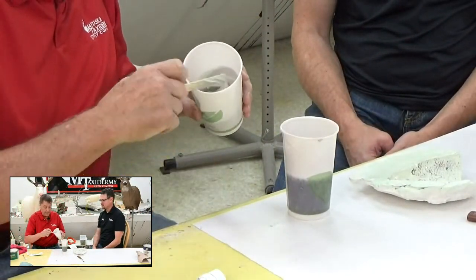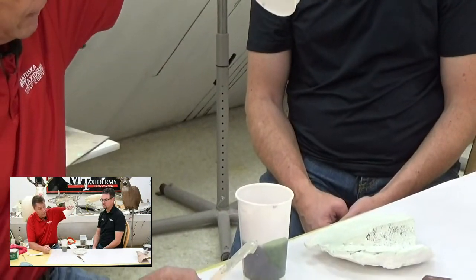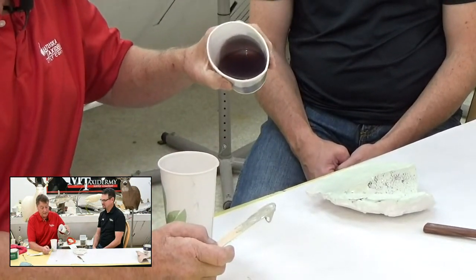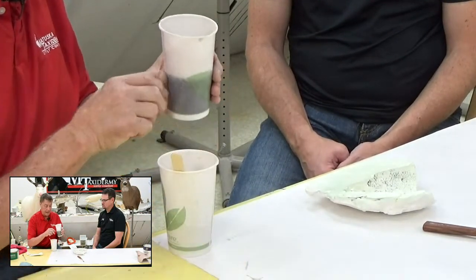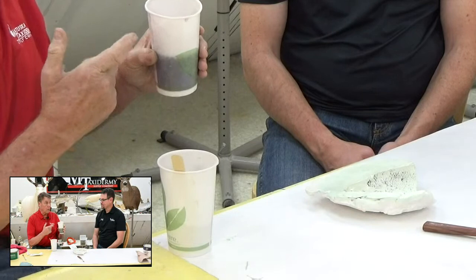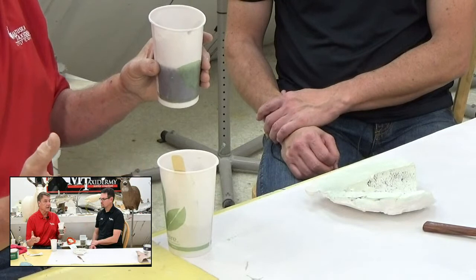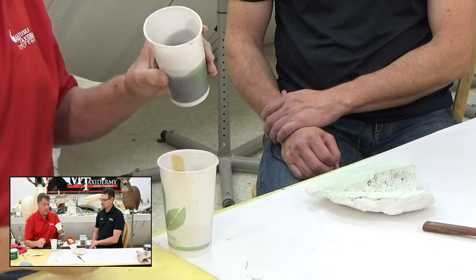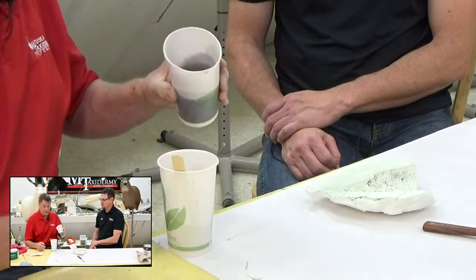Okay, now, like I said, Auto Body Putty, there's no pouring it. I can't pour it into that mold yet. So we're going to take some polyester resin, and polyester resin comes in all kinds of different varieties. Like we've had catalogs. You can buy polyester resin for whitewater canoes and kayaks, so that it's resilient. It's got a lot of flex in it. You can get flexible polyester resin, all different varieties. This is just basic laminating resin, which we use in the shop to make deer molds and things like that.